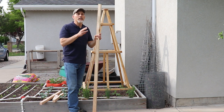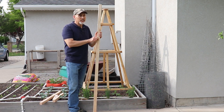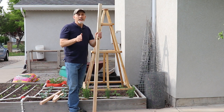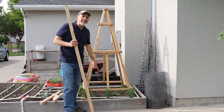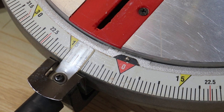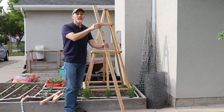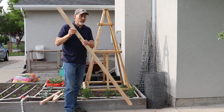If you're going to rip them on a table saw, you need three two-by-four-by-eight-foot lengths. If you're going to buy them as two-by-twos, you will need six two-by-two-by-eight-foot boards. Then we're going to cut these down using a chop saw. My daughter, who is amazing at math, figured out that I wanted these to be 30 inches wide inside at the base, and she calculated using trigonometry that the angle needed is 12 degrees. We want four boards cut to 72 inches long with parallel 12-degree cuts at top and bottom to make up the long sides.